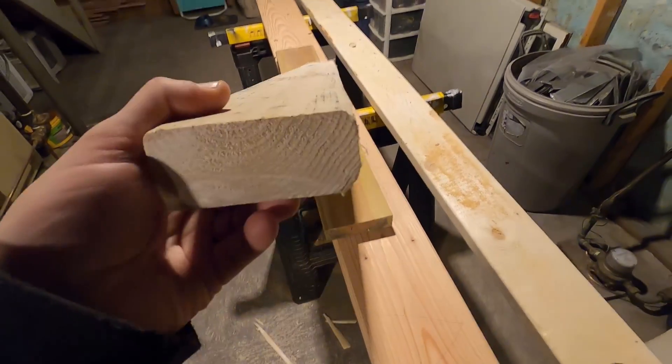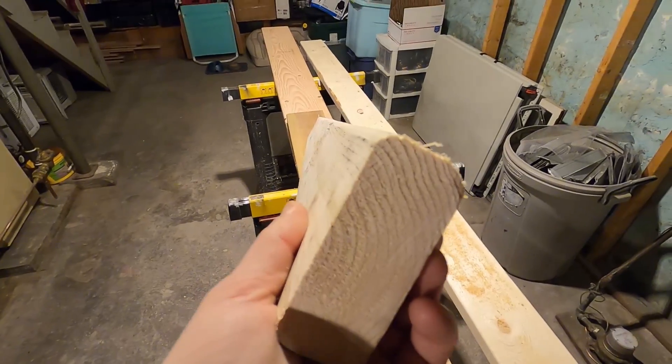When it comes to crowning, I usually crown a board if it's eight to ten inches wide and eight feet long. But mostly this is for longer lumber. I've seen people crown all of their wall studs before putting in an eight-foot wall with two by fours. And to be honest, I've never crowned studs for a wall before and I've never had an issue. If you're a framer, let me know in the comments your thoughts on this. I'm assuming that all building materials, no matter the length, have a crown in them.